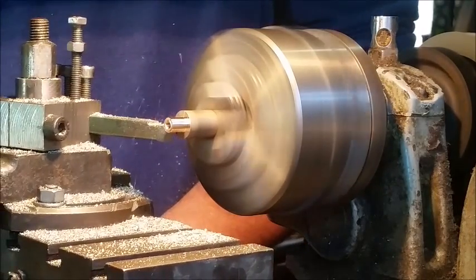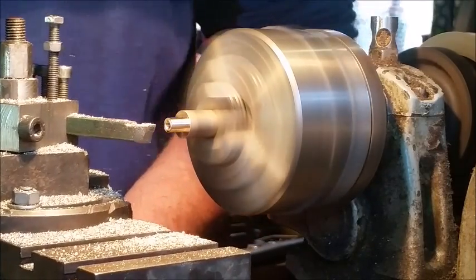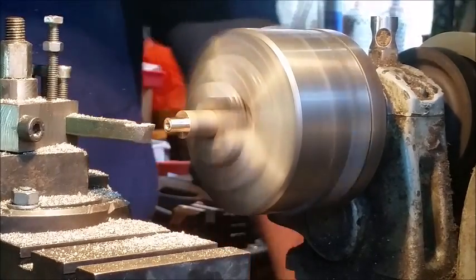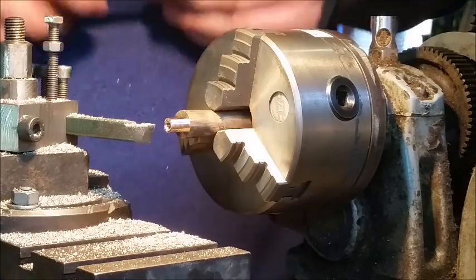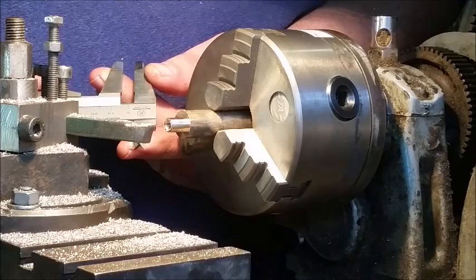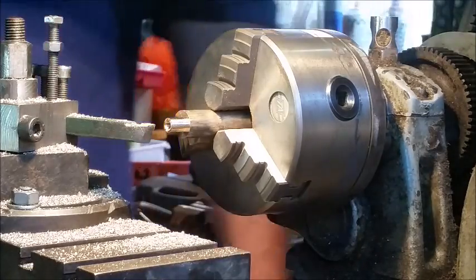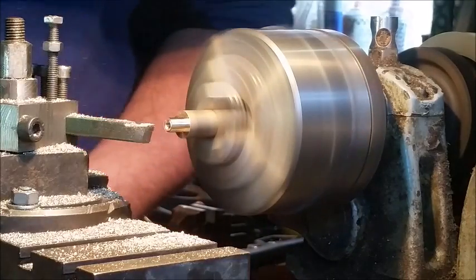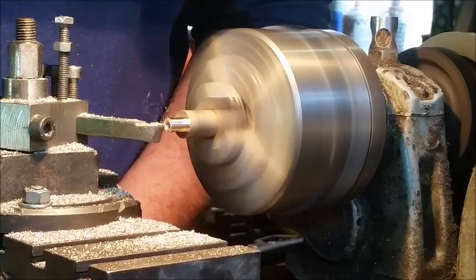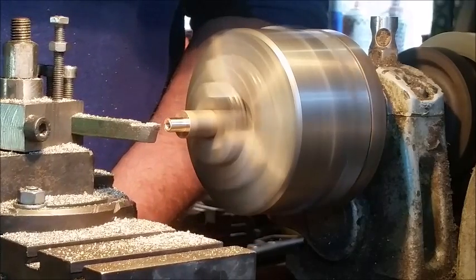Now I generally draw my holes in my pommel about 7 millimeters. So we're approaching 7 millimeters. Can I get the vernier? We're going to check, just put it at 7 millimeters. There we go. It's a little bit big. Now I'll turn a little slower to keep those lines nice and neat. Also, we don't want to remove too much. We're almost where we need to be.